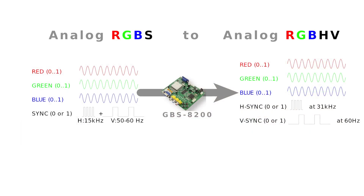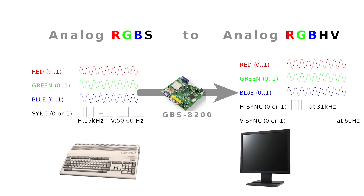So this is why it is not a CGA nor EGA converter. It is an analog 15 kHz RGB-S to standard VGA converter. In case you have an Amiga or another retro machine which outputs an analog 15 kHz RGB-S signal, then GBS-8200 can be very useful. Most VGA monitors don't support RGB-S but need RGBHV signals, and even if they would, most VGA monitors don't support any horizontal sync below 30 kHz. Both of these conversions can be handled with GBS-8200 very well.